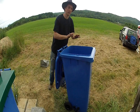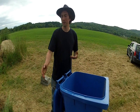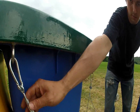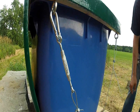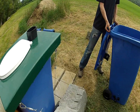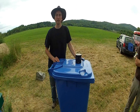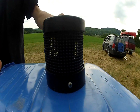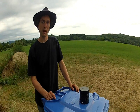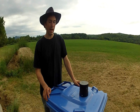When this container fills up at the end of a season — they're modular. The carabiners and this turnbuckle loosen up, you unclip the wires holding it in, take off the whole lid, put the lid aside, and the blue bin wheels out. The lid goes on top and has ventilation on top of a little chimney — four holes screened — so air coming in at the bottom and percolating up through the compost pile can exit through the vent on top. All vents are screened, and that's critical.